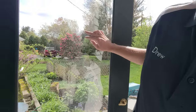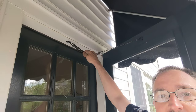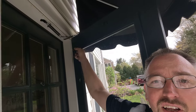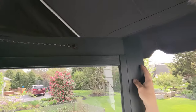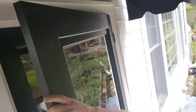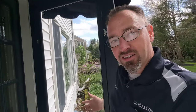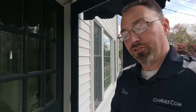Another thing that can really save you is setting up a system with a spring-loaded catch. That's going to absorb the impact and shock of the door opening. You've got a keeper spring that keeps the door from draping, hitting the glass, and hitting you in the head, and it's connected to the door — simply screwed on, or you can through-bolt it. If you've got really heavy winds, you can also consider re-handing your door the opposite direction so the backside goes against the prevailing wind, where the wind is trying to shut the door rather than rip it open.